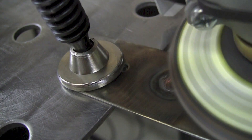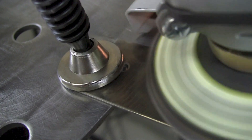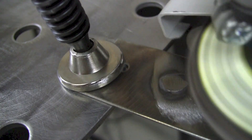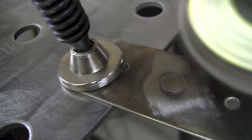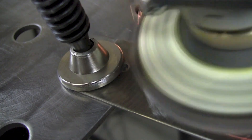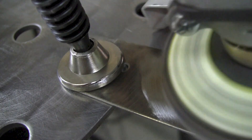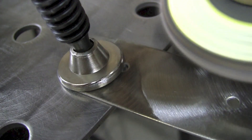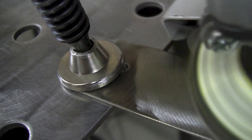We're going to do a little finishing on the back side of the weld. Notice that I sand primarily only in the region where the weld's at — not all over the bracket. There's no reason to zap the clamp and screw it up, so be careful when you're sanding. Sand just till it's blended and just till it's gone, then stop. Call it quits right there. There's no reason to keep sanding.